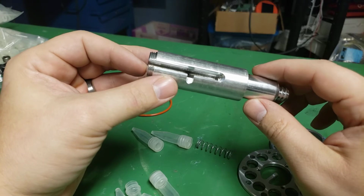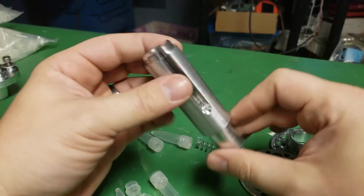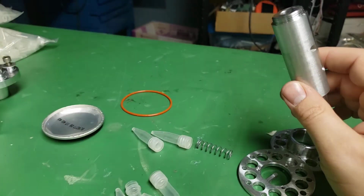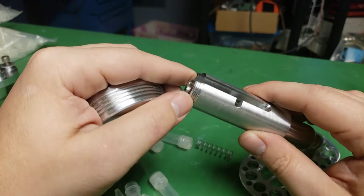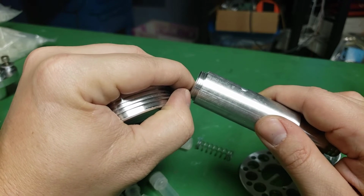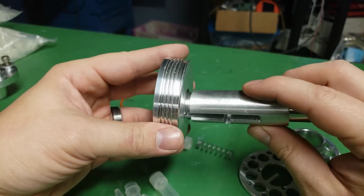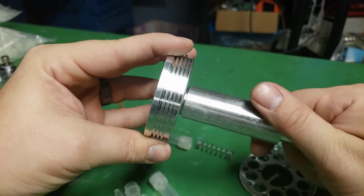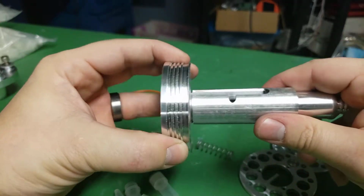And then I put it on a rotary axis and held it like this. And on the secondary op, I did the thread mill here too. So this thread matches this thread. Again, it's a standard diameter thread, but I believe the thread mill I had is not the correct pitch, number of threads per inch, but it doesn't matter because I used the same thread mill on both, and then these two pieces just thread together. Of course, it's not easy to do while looking through the camera screen. So then those thread together.